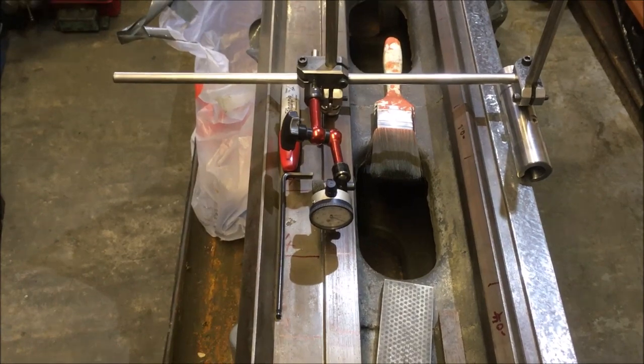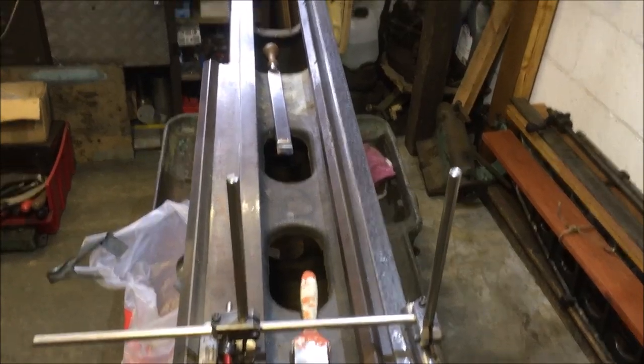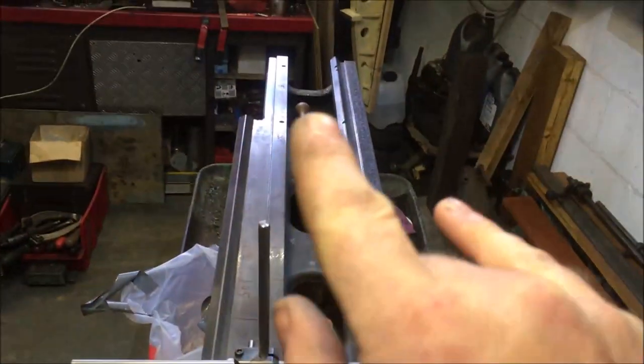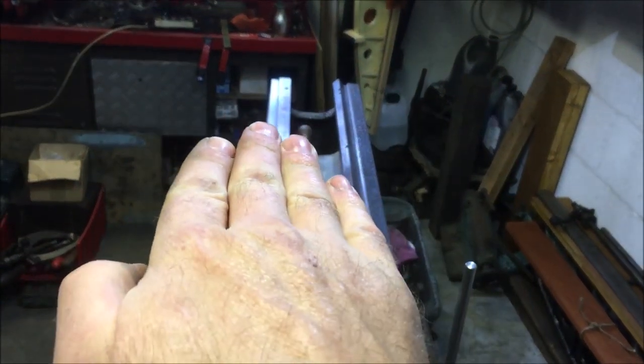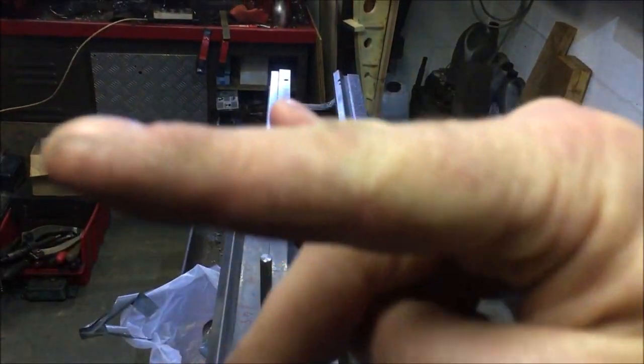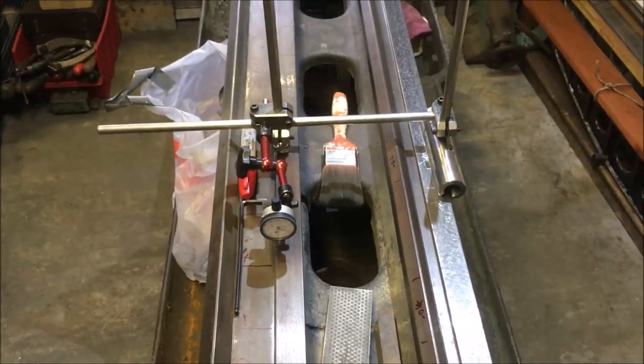So in combination with a straight edge print and then spirit level from that end and this end, and for good measure one in the middle to make sure that this face and that face are in line. Coplanar, I believe, is the term. I waffle on.